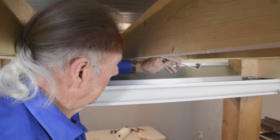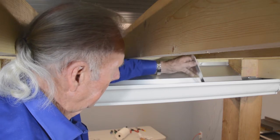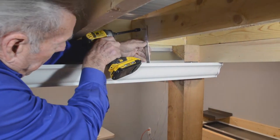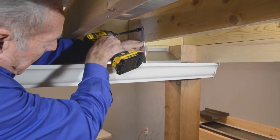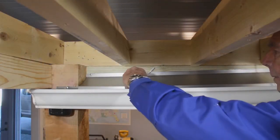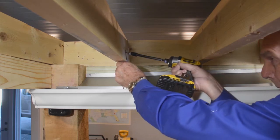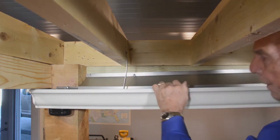Install the gutter joist hangers. Screw the gutter joist hanger to the joist above. Install one on every gutter hanger. Remember, the gutter supports the weight of the panels on that end of the underdeck. Install the joist gutter hanger toward the back side of the gutter to ensure there is enough room to allow for the eventual removal of a panel.